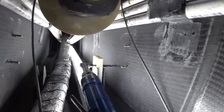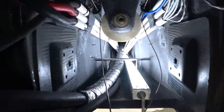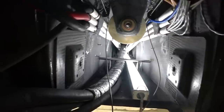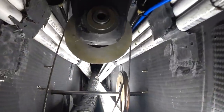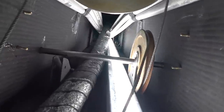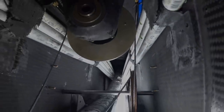Up the front I've got the fixture in, and I figured out where the hole needed to be in that one. It was a different position, so I've got my jig done, drilled that hole on both sides, and enlarged it with a step drill — that was pretty easy. There you can see I've got the half inch rod in there now. I'm just fitting it now that the pulleys have arrived, just mocking one into place and double checking that the alignment is correct. It lines up nicely with the upper wheel, and the bottom wheel is still lining up — that's just a matter of putting the spacers in the right place.